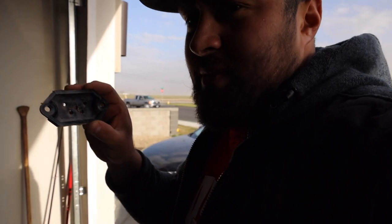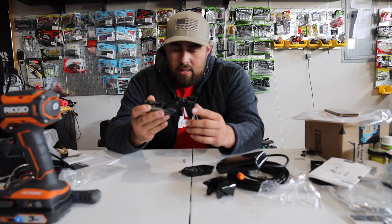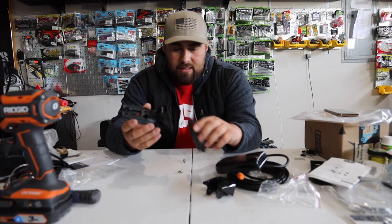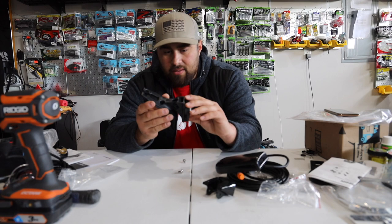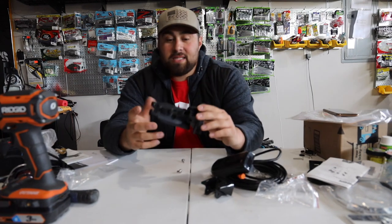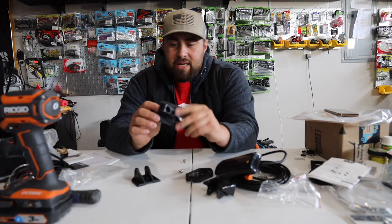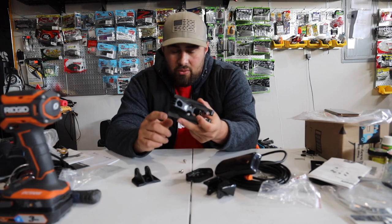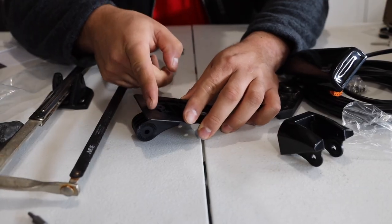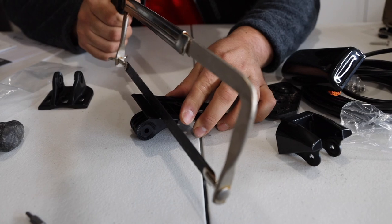That's more or less what your mounting plate should look like. The idea is we're going to flip the mounting bracket, saw off the back, and that way this can sit level so when we mount it the transducer is going to fit. We're going to cut — and I've really thought about it — I don't think cutting this is going to affect the integrity of the fish finder. We're going nowhere near any screw holes. There's a little line along the back from when it was made, and I'm just going to follow that line and cut it.